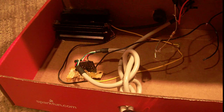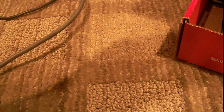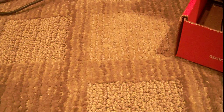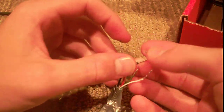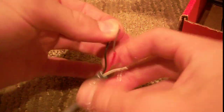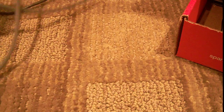One really helpful tool in testing this: you want to make sure you're getting 5 volts on the power lines to the USB and about 2.5 to 3.3 on the data lines. What I built is a cable that plugs into the USB. I plug it in, and on the other end I've cut the cable and tinned all the leads. Right here you have the shield — I left the shield disconnected from this design because there's no data being passed. You can connect your multimeter to the positive and negative to check the 5 volts, and connect your multimeter to the data lines to check that they're getting the correct voltage. This is extremely helpful for testing, and also the power light, just making sure it comes on — because in the car you don't usually have a multimeter, although it's handy.